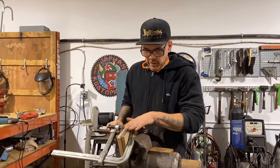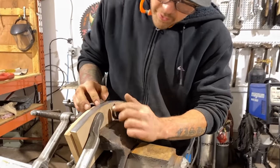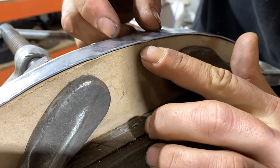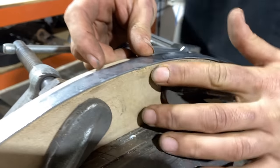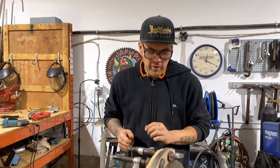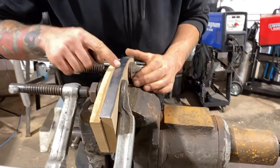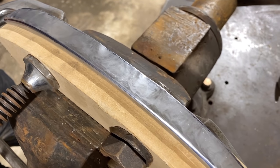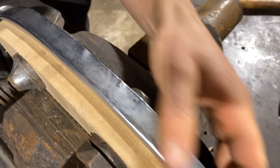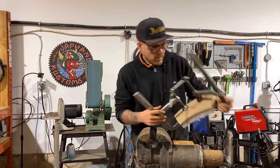Right now I want to point out that in some areas the hammer form was a little too weak, so we've got small imperfections — little divots where it wrinkled into the softer MDF. That's not a big deal because we can easily hammer and dolly those out. You can also see the shrink pattern in there — these lines are where the metal has pushed itself together.